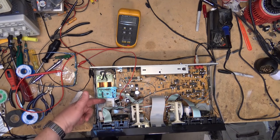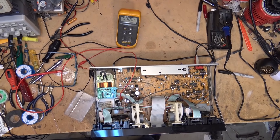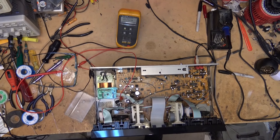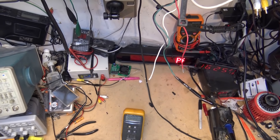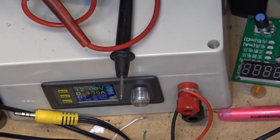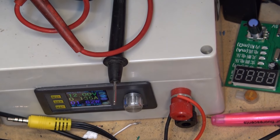We'll load the tape up, press play, and then I'll just turn on the power to the supply. Oh — hello! We got sound. That's the problem: we have a popped regulator. That was a nice easy fix. This is where external power supplies come in real handy, and that little $20 one that I built — that's a great little addition to my bench. That little power supply that I got from Banggood — wonderful little power supply.